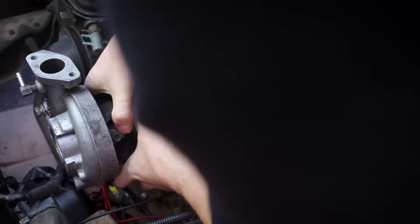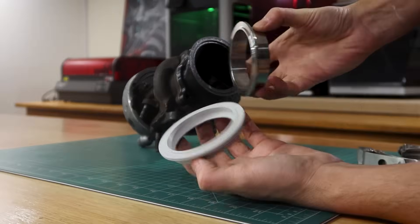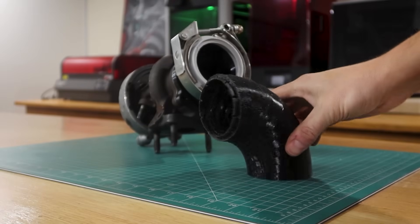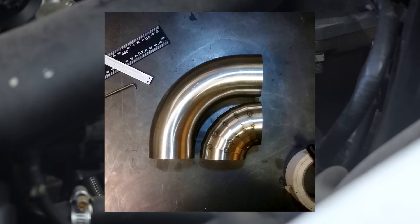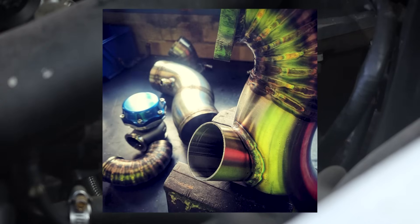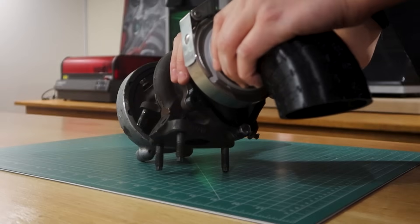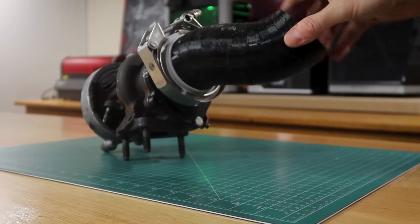All looks like it's still going to work well. Seeing as I've come this far with mock-up templates, there's something I made years ago that I might as well incorporate as well. I also printed the other portion of the V-band coupling so I'd be able to attach these, which are pie cut templates. Believe it or not, I'm not the biggest fan of pie cuts unless they are actually required in order to get a tighter radius than you can get with a mandrel bend. This image of the dump pipe I made for my 180SX shows how pie cuts can get you an even tighter radius on a bend than would otherwise be possible. These pies that I've got printed here are actually sections of a regular mandrel bend — that is to say, 10 pieces, 9 degrees each, makes a 90 degree bend. I've already got them, so I might as well use them to mock up some exhaust flows.